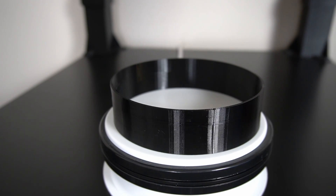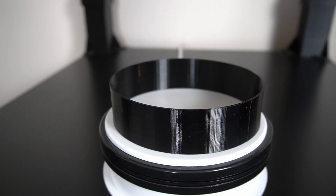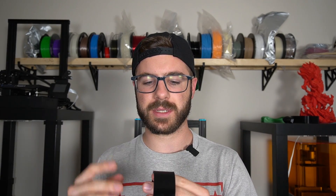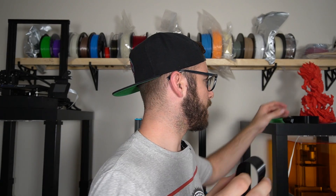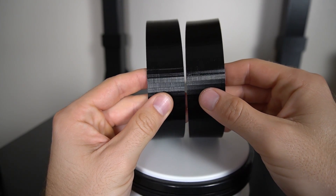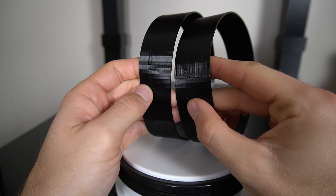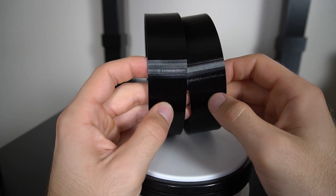The print itself of the little rubbery gasket portion turned out pretty similar to the before-dry version. There was actually a layer shift on this one, which I found ironic — I was expecting a beautiful print and got a layer shift. I'm going to attribute that to something with the machine and not the filament being dry. The seam portion that had a little bit of hairs on the first print has no hairs on this one, so that printed a little bit better. One thing Erin noticed — and I don't know how well this will translate on camera — is that the actual color of the filament is quite different. The black before being dried is much more of a matte or satin type, while after drying it's much more of a vibrant, glossy black. So moisture actually had an effect on the color.